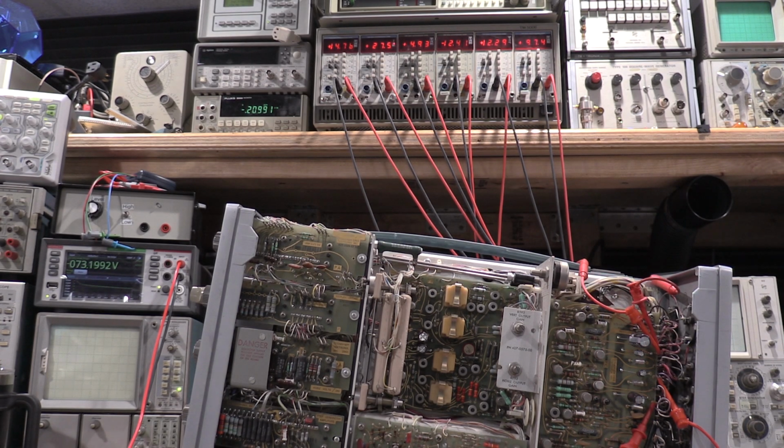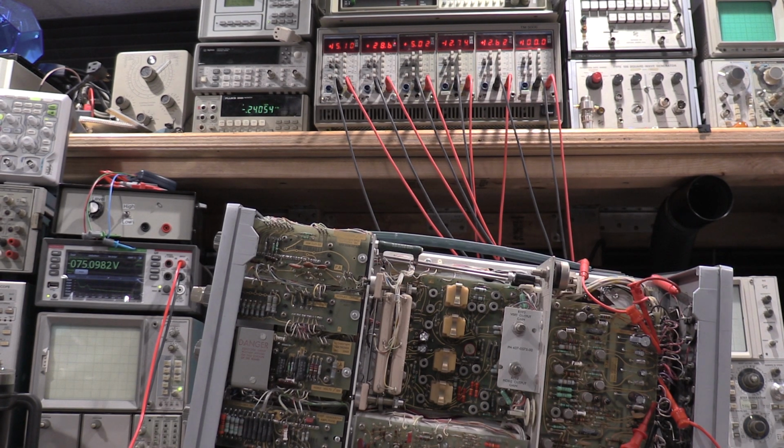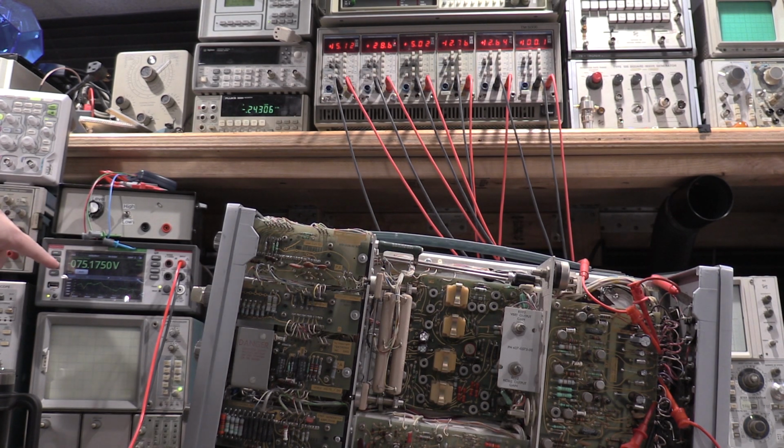Okay, the negative 75 volt adjustment pot is right here. It is not taking much. I'm just bumping this control. Well, we're going to call that good right there. 75.16, bouncing between 1.6 and 1.4 with line voltage. So that's good. Tolerance on that one is plus minus 0.375 or 0.5%. So we are very good on that.